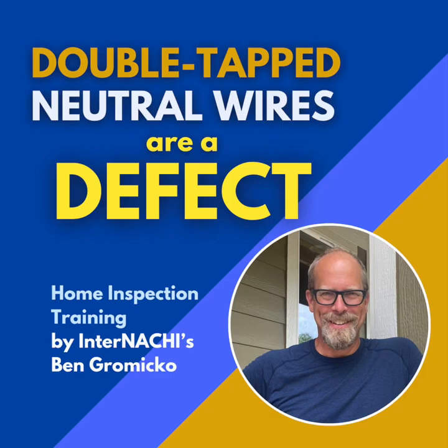That's genuinely scary. Fire risk is huge. It also makes working on circuits much trickier and potentially dangerous. Let's say an electrician needs to isolate one circuit for repair — they go to loosen that one screw holding two neutral wires, and they might unknowingly disturb the connection for the other circuit sharing that screw. They can inadvertently loosen or even disconnect the neutral for a totally different circuit without realizing it immediately, creating unexpected hazards elsewhere in the house.